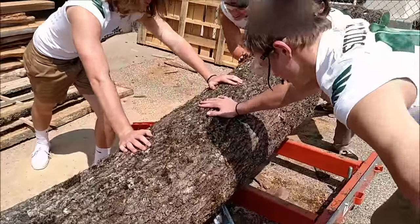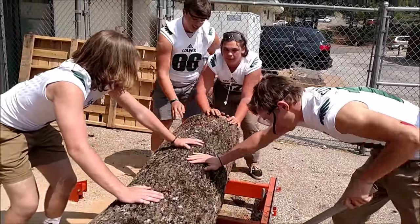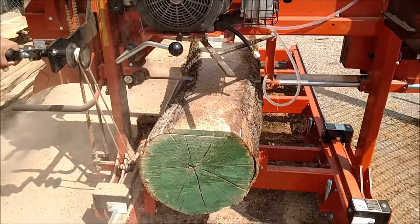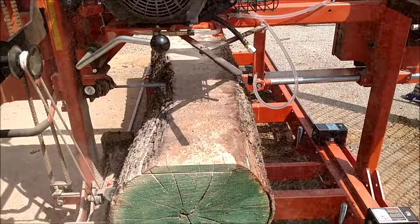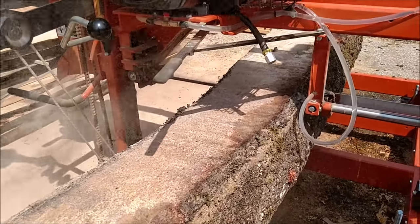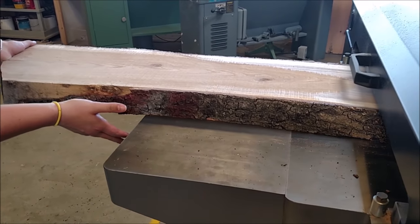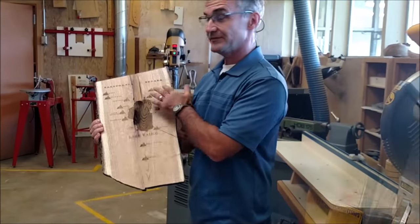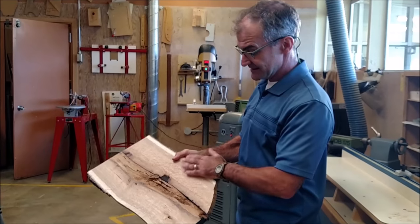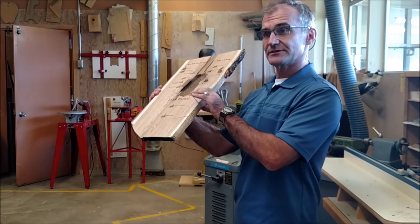It's probably a thousand pound plus black oak log. I milled this board a few months ago, let it dry, and planed both sides down. It does have a big rock pocket in it, but I think it's going to be okay. Once it was all done planing, I checked the thickness with the calipers — it was 0.93.